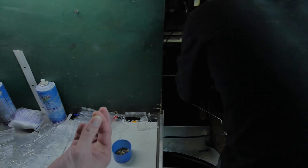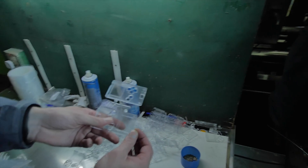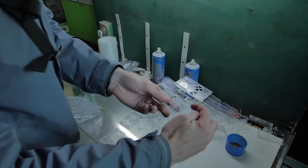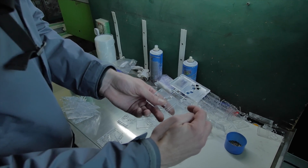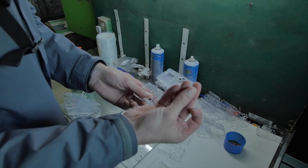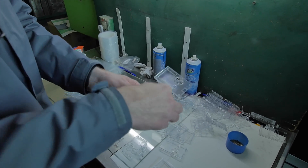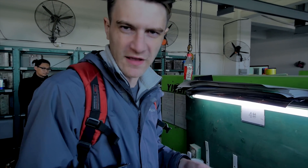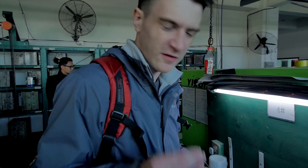So you're having these fasteners installed inside the mold? They're placing them inside the machine so they'll be inside the injection mold once it's done. That way, these have threaded inserts so when we put a screw in through it, it won't rip out the plastic. You won't be in danger of stripping the plastic — you'll have these little metal inserts in there.